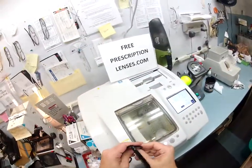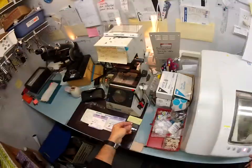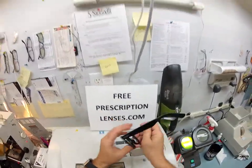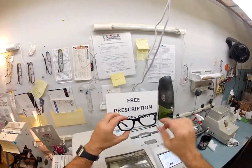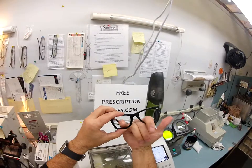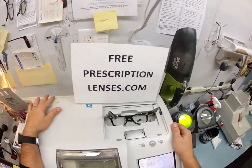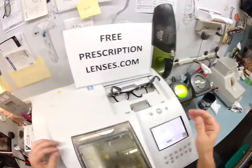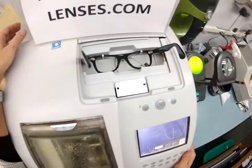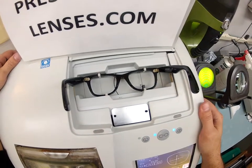The first thing I'm going to do is pop out your original demo lenses that Ray-Ban puts in there. I'm going to send these to you, so if you ever want to sell these frames years from now, you'll have the original lenses — they belong to you. Now this is your frame. It's based on the original Wayfarer sunglasses; they just put the ophthalmic glasses in there and call it the 5121. So I'm going to put your Italian design frame into my Italian Santinelli LE 1000 patternless edger, and it's going to trace the shape of your right lens and then pop over and trace the shape of your left lens.